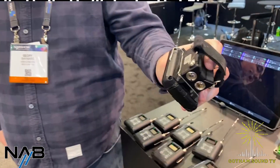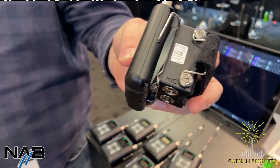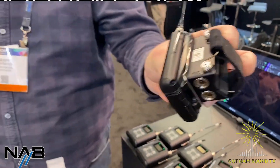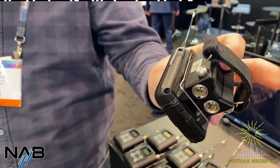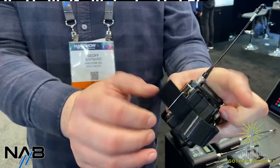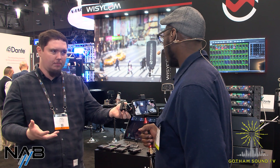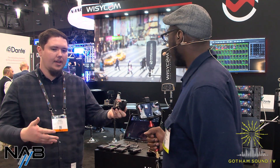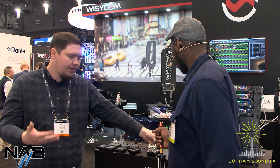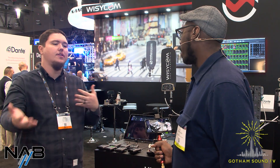What we're also very excited about is our new PHA-60. I was a fan of the previous model, so tell us more. This one is a new approach — it slots right on the back and attaches to your favorite boom pole. This does 48-volt, as you would expect, but it also has a setting to toggle to 12-volt mode. Because some mic manufacturers are looking at portable audio location sound workflows, 48-volt mics take a lot more battery consumption. If you can do 12 volts, you get a lot more out of your day.